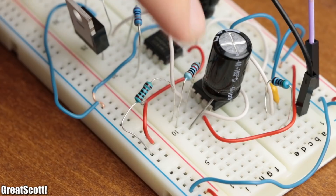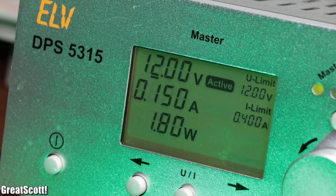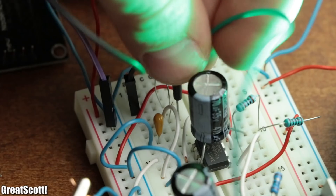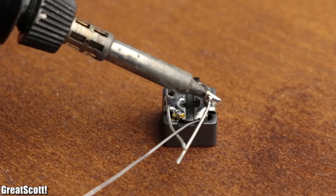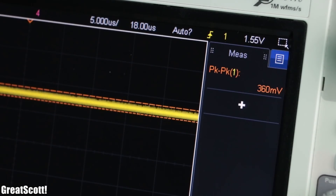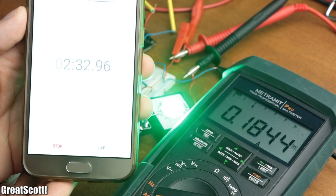Now with the theory out of the way, I created the described circuit with proper components on a breadboard, powered it up and noticed that it only works partly. We can control the brightness of the LED, but apparently with a slight offset of the constant current. The problem is that due to the fast current rises, our reference voltage from the ESP8266 gets distorted. So to slow it all down a bit, I added a 10uH inductor in combination with a flyback diode in series to the LED, which pretty much solved the problem completely. Now we can set a constant current between 25 and around 300 milliamps, and the current value stays constant no matter how much the LED heats up.